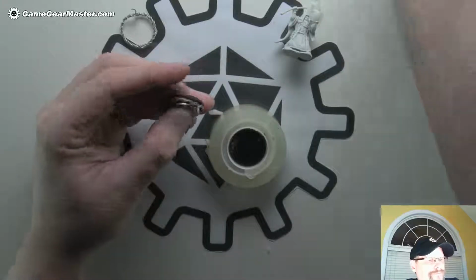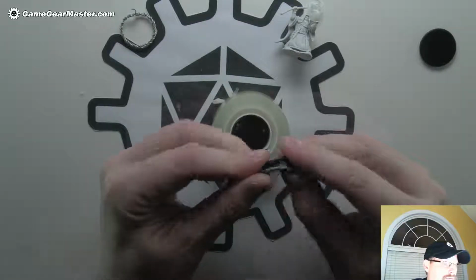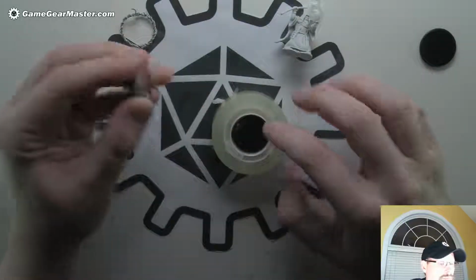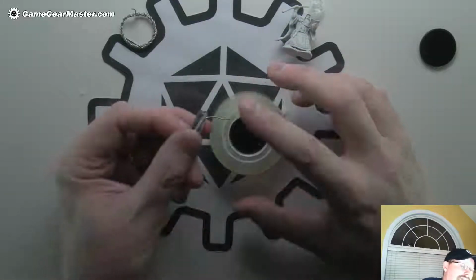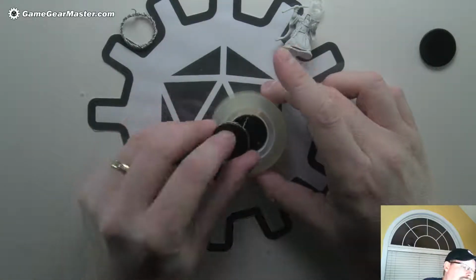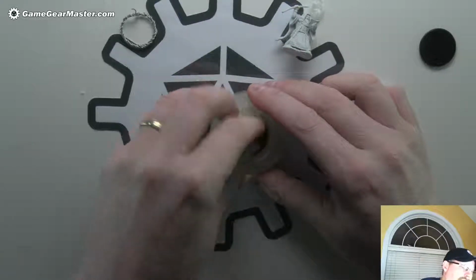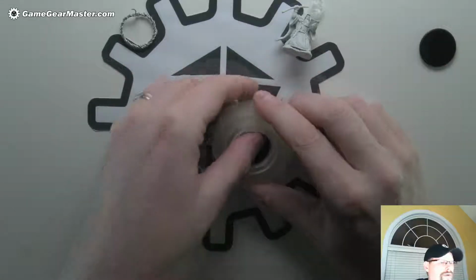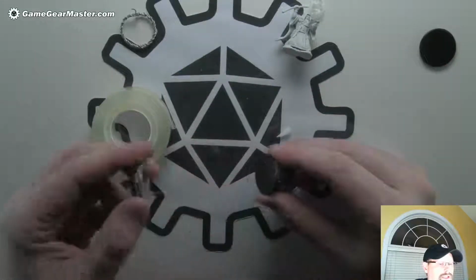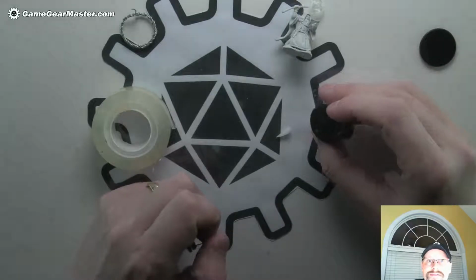So it makes sure that the depth of the actual coils is correct to accept a battery and hold it in place. So then what we do is we take these 2 bits, and we're going to pour some hot glue into here. And then we stick the wires of the connector through that little hole there. And then we're going to squeeze it down pretty hard to get all the excess glue out. Wait 5 minutes, pull it out, or I'd rather push it out, and take it apart, and we'll have a little mold. We'll have a little base ready to go.